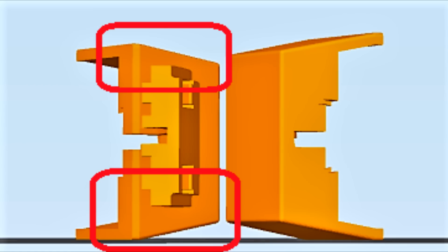The easy way would have been to just stand it up, but then it would only be as strong as the bond between the two worst layers of the part. Printing it sideways means there'll be a little more sanding on the horizontal edges, and that has to be taken into account when designing the part.